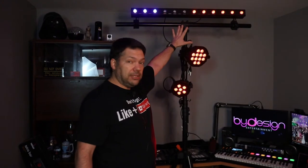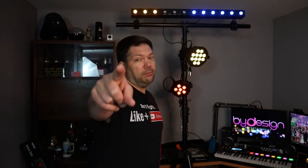You can see that the Tetra 6 is red. And what I'm gonna do is plug a DMX cable from the output to the input, from the output to the input. And I'm gonna put these all on DMX channel 1. And we're gonna use this to master slave them or control them. I don't know if that's politically correct to say anymore, but that's the terminology in lighting.